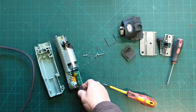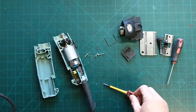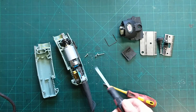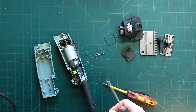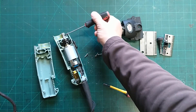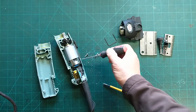The interior of one of these — the cable decided to have a twist in it, let me just straighten that out. They're not my favourite clippers. A lot of people have the Lister Star, probably because they're fairly cheap compared to some of the others. But as you can see, it's only got a little tiny motor in it. If you think about some of the other horse clippers we do, they've got really big heavy duty motors — this one is quite small, you'd probably find this on a radio controlled car or something like that. But you've got your gears which attach to the head, a little bearing, a fan, and the motor. None of this is serviceable — it's a complete replacement.